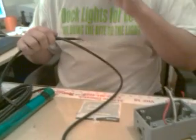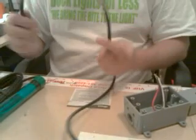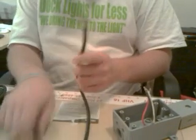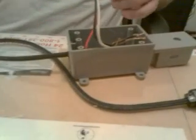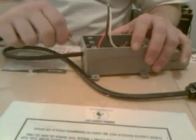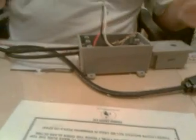Take your wire — let's say this whole unit has a plug on one end and the light on the other. I usually cut it about two feet down from the plug, then split and strip the wires. Take one end and stick it through one of the holes you drilled at the bottom, feed it through, and pull it in just enough so you can work with it. Then do the exact same thing on the other side for the light — just feed the two wires through.